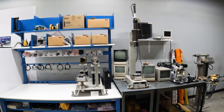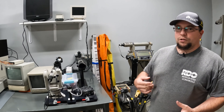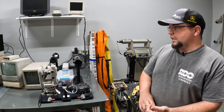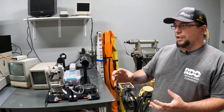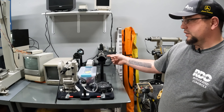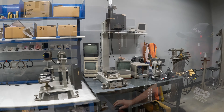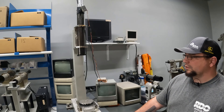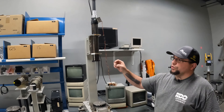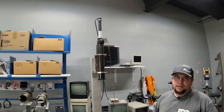This also goes back to the robotic total stations for repairs and calibrations. With robotic total stations, they do angles, electronic distance measurements, and they move by themselves to stay on a prism. This collimator handles both the electronic distance measurements and the tracking for the prism system. This one moves more toward our rotating lasers and millimeter lasers. For lasers that have a vertical beam, we use this collimator to calibrate that beam and to align the rotary head of the laser.